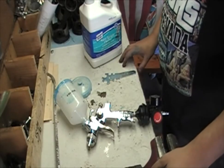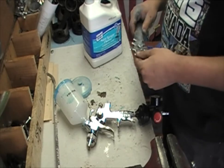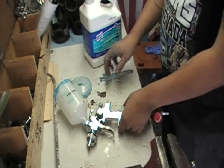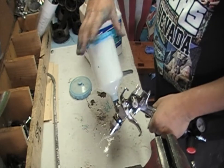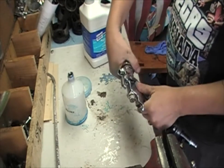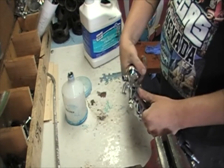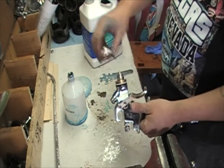Now, when you're all done with the gun and you're ready to clean it to go onto clear coat, or you're just ready to clean it and be done with it, you should look in your kit that came with the paint gun and there should be a tool that looks something like this. You can use a regular wrench, but you'll need either a regular wrench or one of these — these are nice to have. The first thing you're going to do is take the pot off or the cup and set it aside. Then take off your spray nozzle — this should be hand tight. If you need to, you can wrap some kind of wrench around it if it's too tight, but it shouldn't be. This should only be hand tight, as tight as you can get it by hand. Undo it and set that aside.